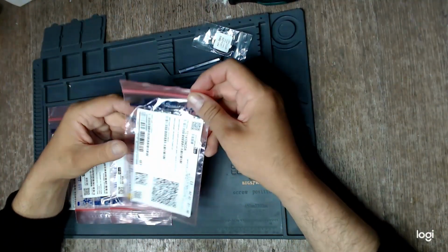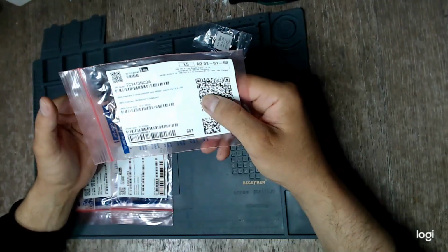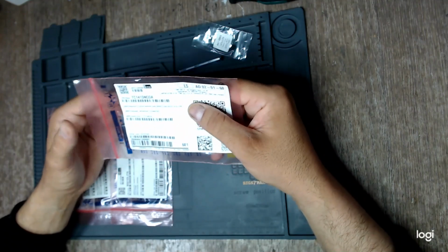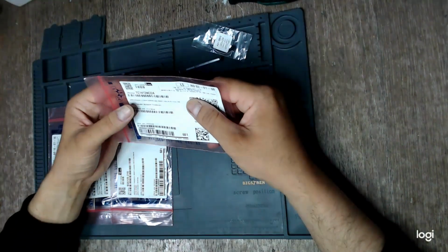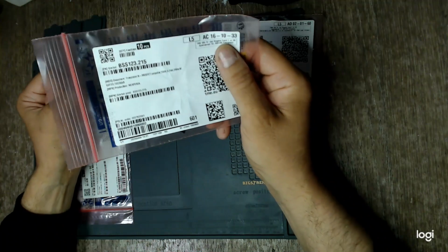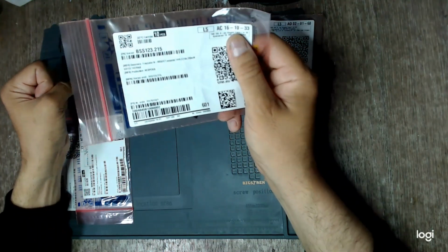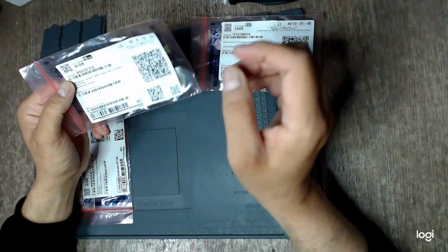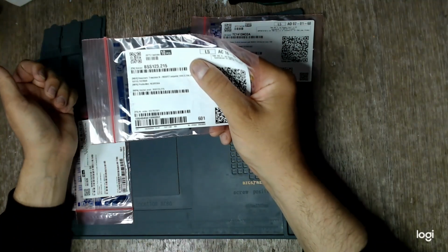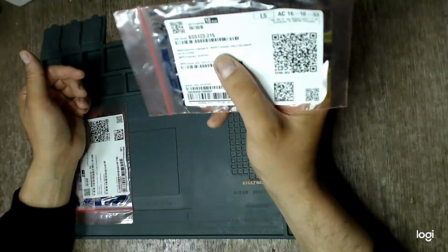So the replacement parts from TME have arrived. Mainly the driver, the gate driver, the non-inverting version. Non-inverting means that the output is in phase with the input. And also the MOSFET. This MOSFET is located on the faulty fan board. That Zener diode was limiting the voltage on this MOSFET's gate. I did measure that MOSFET and it seemed fine, but I did not want to take any chance, so I ordered a replacement MOSFET just to be sure.